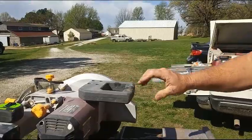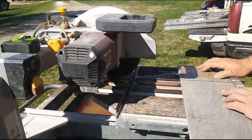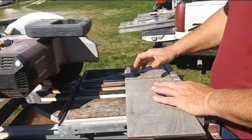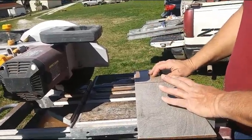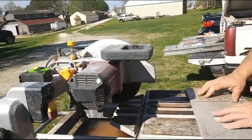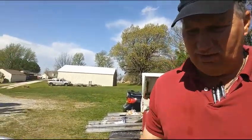If you notice, the speed of that motor is letting you know — don't push me too hard because I'm going to bog down. You don't want that. If you're going too fast, it'll end up breaking pieces near edges. You don't have to have this nice of a saw. I did big jobs with a little bitty $50 saw you can get at Harbor Freight.